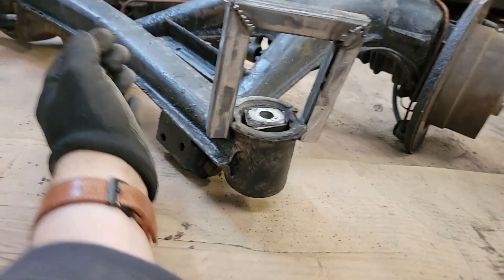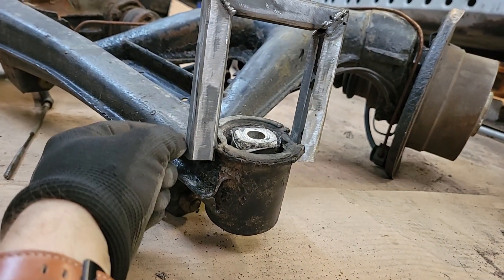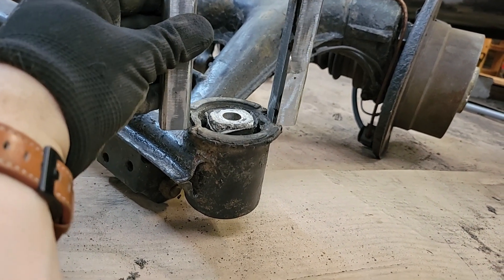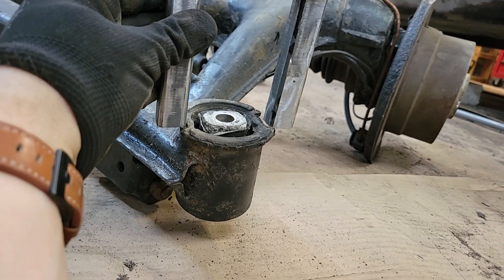So I've tacked together my little U-shape. Look at the welds on the left, don't look at the welds on the right. And what you can see is it's slightly too wide — it's not sitting on the rim, it's going over it. So you just need to narrow that slightly so that it sits on that rim there, and then weld it up.